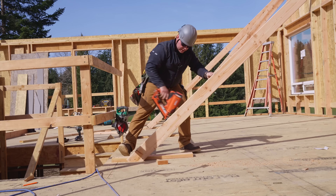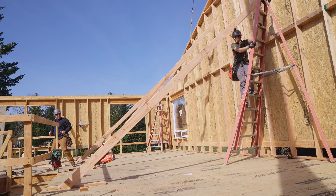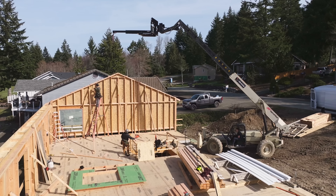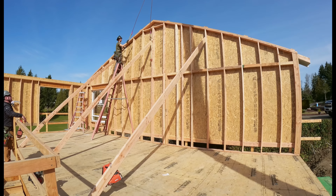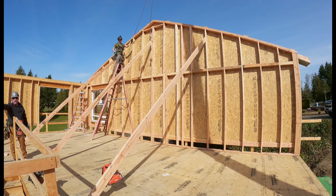Ten years ago, we had a 16-foot tall wall with 16-inch soffit, kind of like the left there. Just imagine that wall — 16 foot tall. We had it braced adequately. It was safe. In fact, we had left the house for a month while we went and worked on a friend's house. In the interim, we had snow and so on. I got a weather alert that said we were going to get high winds, so I went out and added like four or five more braces. The next morning we rolled in — the wall was laying up against the neighbor's house.